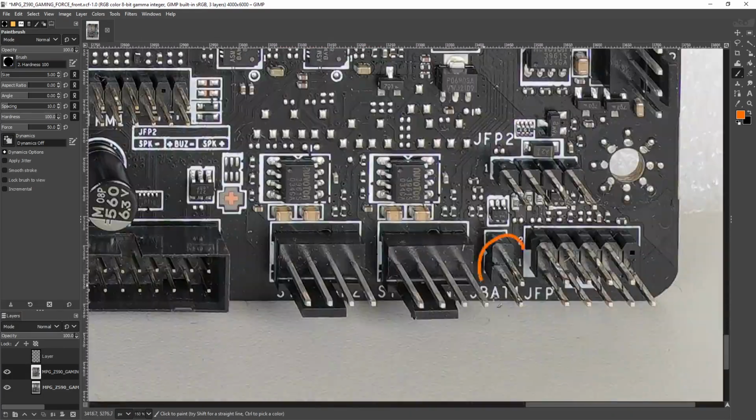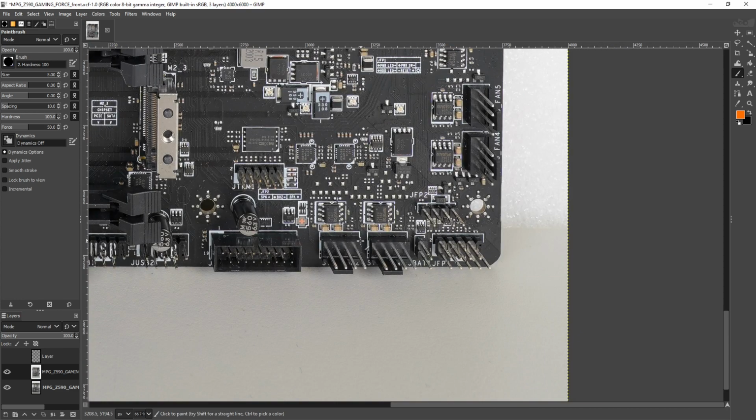Then we've got a clear CMOS jumper down here. So, if you have the board in a case, you might want to wire that up to your reset button so you don't have to take off the side panel every time you screw up your settings. Though this is an MSI motherboard, and it doesn't come with safe boot, or a retry button, and I don't really have a problem with that on MSI boards as much as I do on, say, Gigabyte or Asus motherboards, because on Gigabyte and Asus motherboards, you punch in the wrong settings and they just don't post. They don't post, and they don't recover.